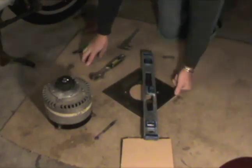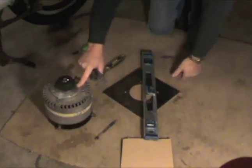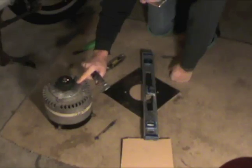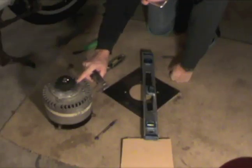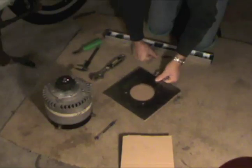I'm going to show you how I'm doing this. I measured from the flange of the motor up to the center of the tooth, which was 21 millimeters or 13 sixteenths. I'm taking the motor plate off and placing it on a piece of cardboard.